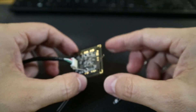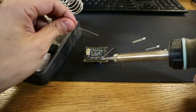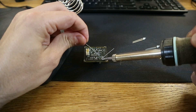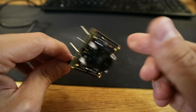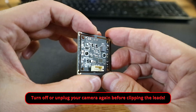Now that the LEDs are roughly held in place, let's get our soldering iron ready. I've also detached the cable and put the board face down for easy access. Bring your heated soldering iron to touch the hole and lead, and after a second or two, touch just enough solder to the well to fill it and coat the lead. Repeat this process for each of the leads, double checking that they are in the right orientation before soldering. When you are finished and turn the camera back on, all LEDs should now be lit. Clip off the ends of the leads and your camera should now look like this.